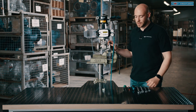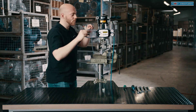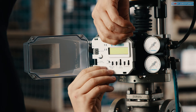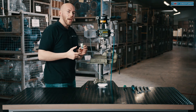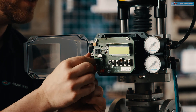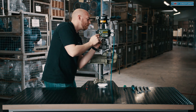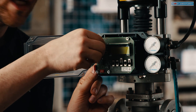In order to install the analog output card the positioner must first of all be disconnected from the input signal. Then we dismantle the cap from the circuit board. The installation of the analog output card is done on the back of the circuit board. Three screws are used to fix the analog output card to the circuit board.